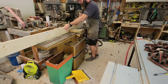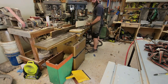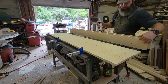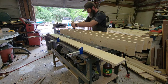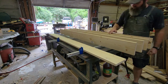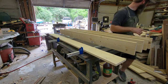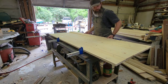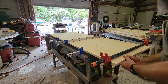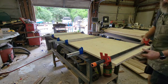One of the challenges when using stuff like this is we don't have any boards wide enough for our side panels. What I'm doing now is joining the edges of these boards so we can glue them up into a panel. I'm putting glue on all the edges — when you glue up long grain edge grain like this, the glue makes a suitably strong bond and you don't need any additional fasteners. I'm gluing all these pieces together into a panel, clamping it, making sure everything's nice and flush, and letting it dry. I had to do four of these total.